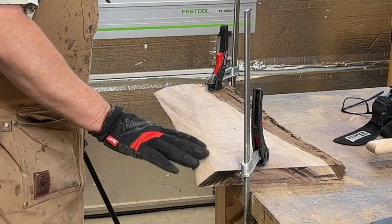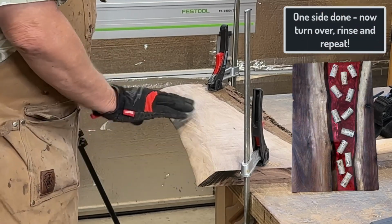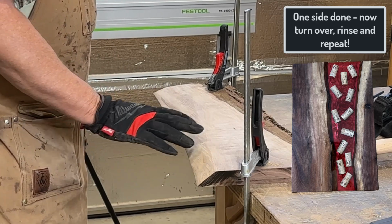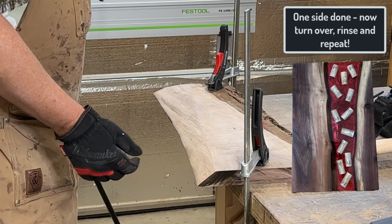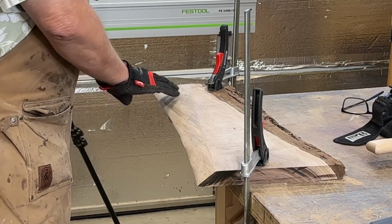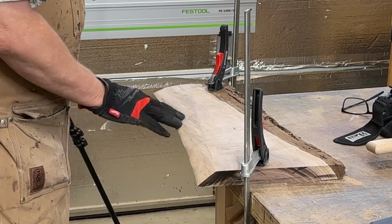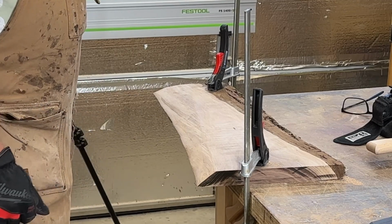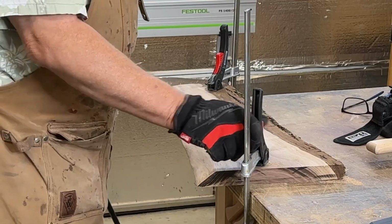You may ask, why do I bother to pull out the grooves in there? The one reason I do it is because I haven't decided whether I'm going to put a bottom thin layer like I did in my wine and cheese board. And if I do it that way, I'd like that clear coat not to show a bunch of tool marks here. If your board is going to be filled completely with opaque epoxy, you'll never see them, and it might even be a better grip. It's just my personal choice to take the time, if you're wondering.